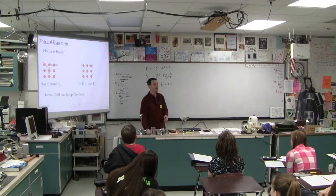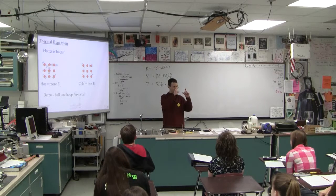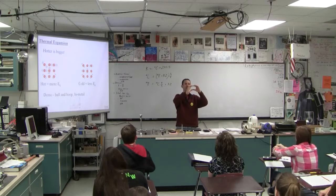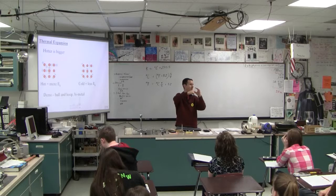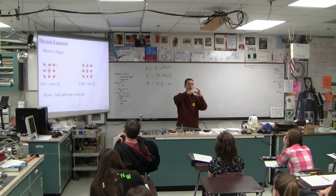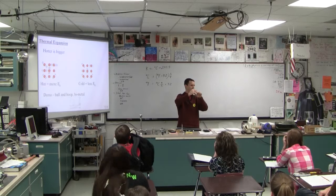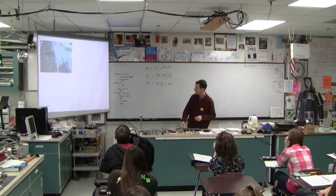It used to have a bimetallic strip inside the thermostat, right? And when it got cold enough, honest to God, there was a vial with a little bob of mercury in there, and it would tip to one side and the mercury would roll to one end. I'm pretty sure they don't put these in houses anymore. The mercury would roll to one end where it would connect a couple wires. Mercury is a metal, so it can make an electrical connection, and it turned the furnace on. So anyway, there we have it.